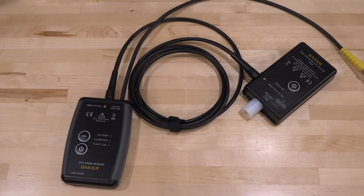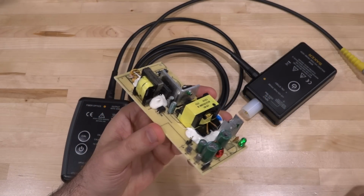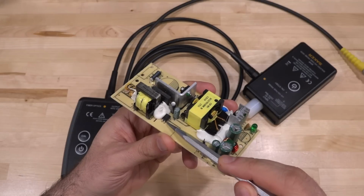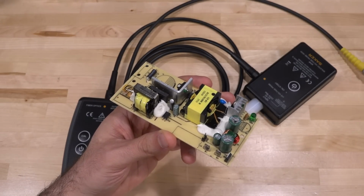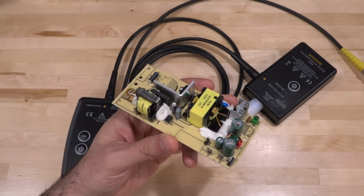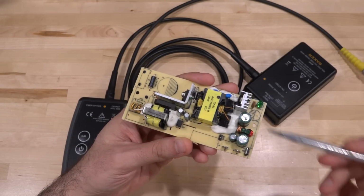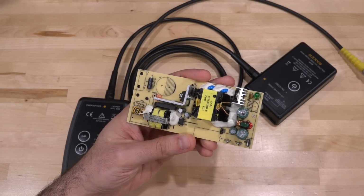And you've seen other reasons why this is useful. This is just a basic power supply, and all of these power supplies are going to have an optocoupler, opto-isolator in the middle, which is exactly the same situation. You're separating two nodes from each other by only connecting them with traveling of photons between them. And that's very useful again because you want to isolate and protect the two ends of the circuit, so therefore you have a different reference ground.